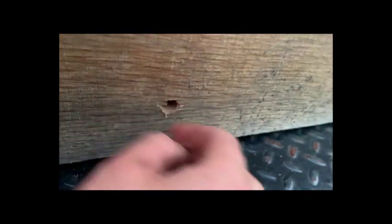To speed up this project, I preassembled it with a deck screw to hold it all in place while I was drilling the holes for my carriage bolts. It's also important that as you're about to break through with the drill bit, just don't push too hard so you don't get a lot of blowout on the other side of the wood.